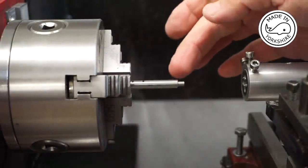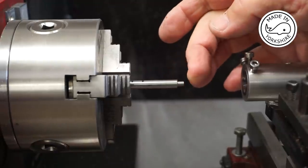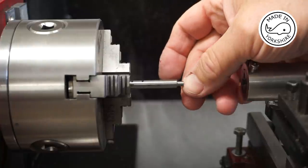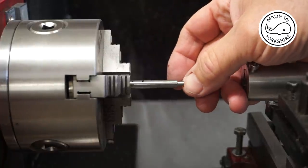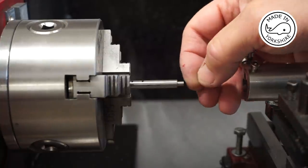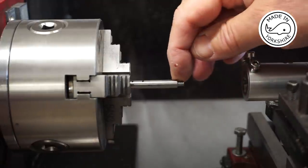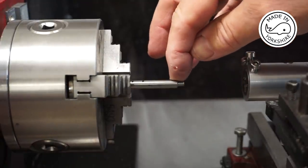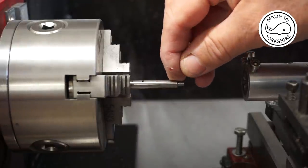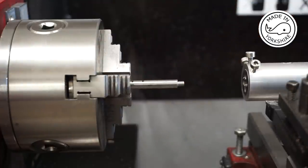Well, the adjusting screw is made out of a piece of silver steel 1/4 inch in diameter, and what you need to do first of all is just turn this end down, and that's the piece that will need to be hardened, and that will be used to touch on the top of the tool. Now this needs to be threaded 1/4 by 40 TPI, and it needs to be threaded for an inch in length,